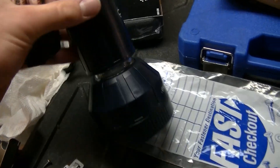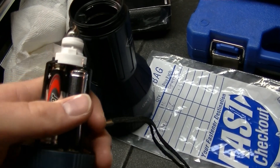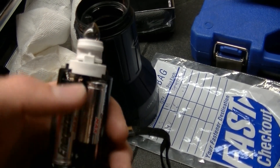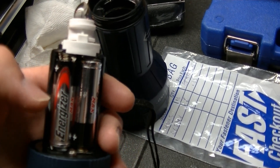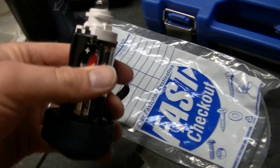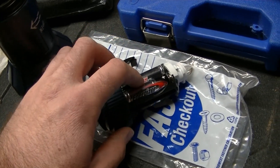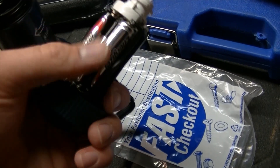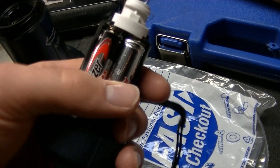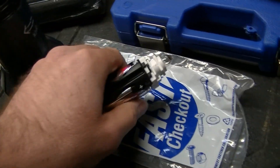There are newer yellow versions of this light and those are actually wired correctly for an LED — you don't have to do any modification or switch the batteries over. And of course they're also 6-volt because they're wired completely in series, rather than series for two and then parallel for each set of two.